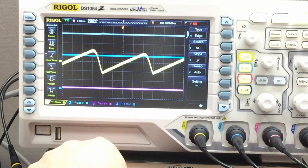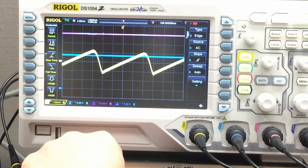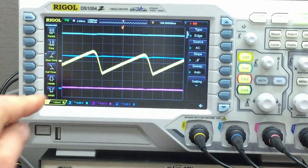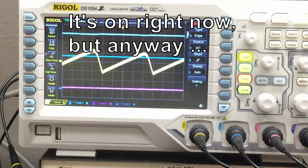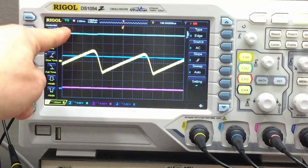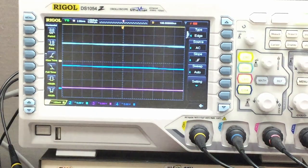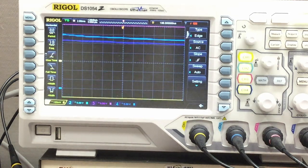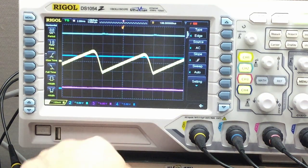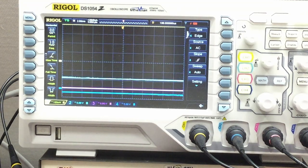So now I'm in the off state. Now the relay is on, and we were concerned about what happens if the relay is in the off state. In the off state, now I cut the AC power, and we see how fast our positive rail is in fact falling. If the relay is in the on state, of course, the voltage, if I switch off the AC supply now, is falling with exactly the same speed.